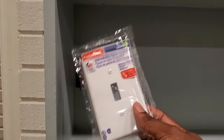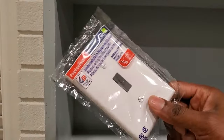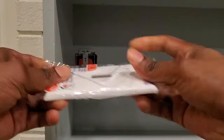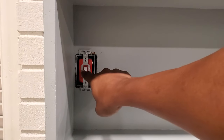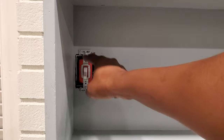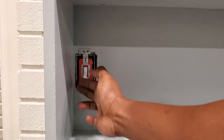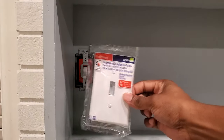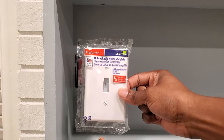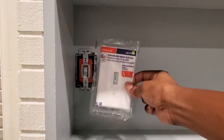These are the ones I'm talking about — they cost about 60 cents. As you can see, they flex pretty easily, and that's what we want. We've got a switch that is very close to the wall, and the problem area is essentially on the left side where it's against the wall. The main thing we want to do is shave down our plate on that side so that it will fit jam up against the wall and we'll be able to use our switch regularly.